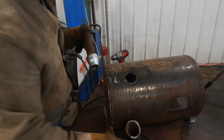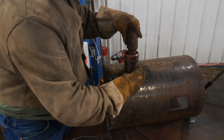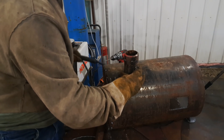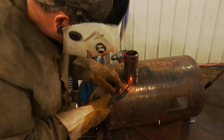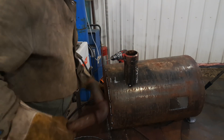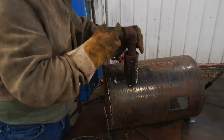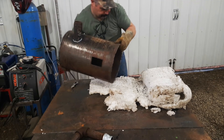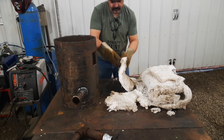Now we're just going to figure this out — get it so the burner slides in, reasonably centered to your piece of pipe, and then we'll just tack it there. Double check our work, make sure the burner slides in all the way. Then we put it on upside down and cut out our inside piece, and we're going to throw that straight in the bottom.